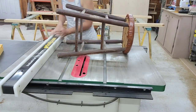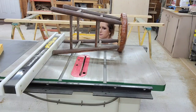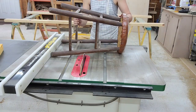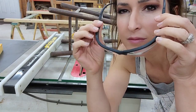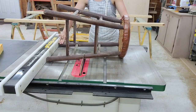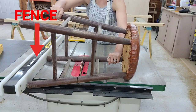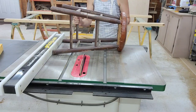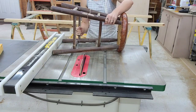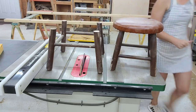The first thing I'm going to do is put the bar stool on my table saw and figure out where I want to cut it — somewhere in between that first and second brace. I have my bar stool up against the fence of the table saw and I'm lifting my blade up to cut the legs. Do not forget your safety glasses — I speak from experience. A table saw will throw dust and wood particles into your eyeballs. Make sure something hard is against the fence so the padding doesn't make it uneven — that ensures a straight, consistent cut on every leg.